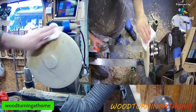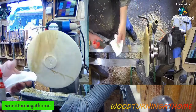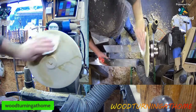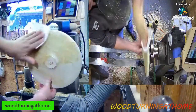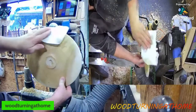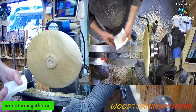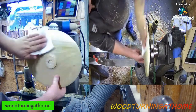Got some nice poplar in the storeroom at the moment. I did some stair spindles. Poplar is my favourite for turning stair spindles because you don't get the knots that you get with other stuff. If you work in pine and you get a knot right where you want to do a bead or a cove, then it's a nuisance. The customer only wanted 4 stair spindles, but she bought me an entire plank to cut that off. I've got quite a lot at the moment. The only thing I find about it is it's very dusty when you're sanding.